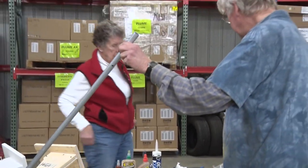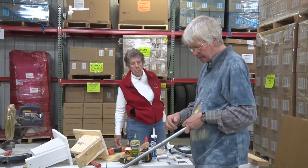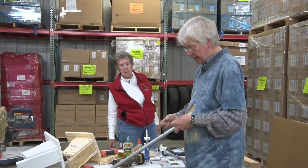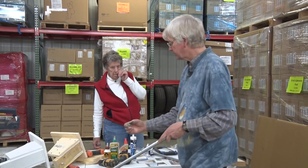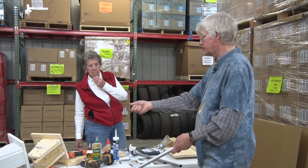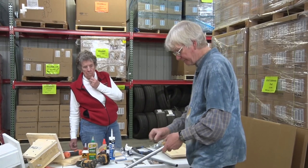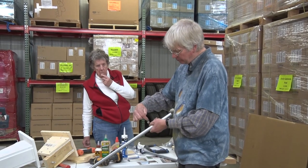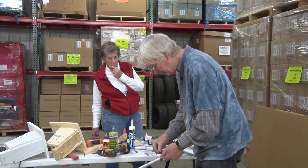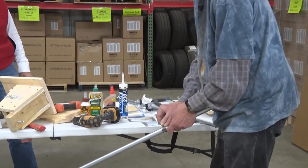Now, you need to do something to hold up your predator baffle. And what I use is these two-hole conduit straps. That's a 3/4 inch, two-hole strap. I've got a bunch of these because I used to use these to help anchor the pole to the back of the box, but I found out over time you don't need it. Just the hex bolt and the wing nut will securely anchor that box to the pole by itself. So then I drill a hole through my two-hole strap, line up the hole with the hole I made for the conduit, and use a screw.